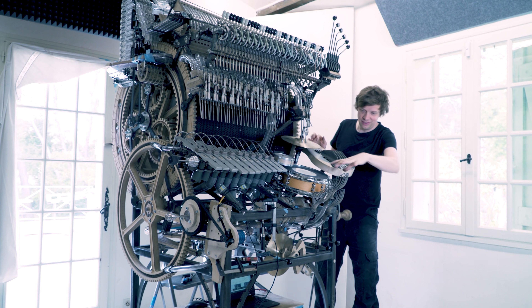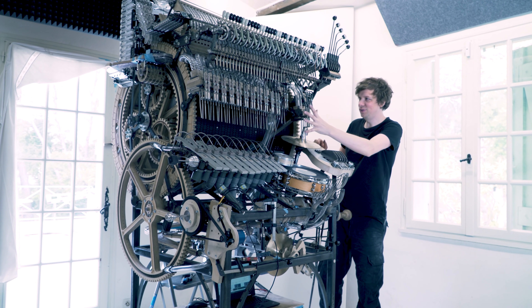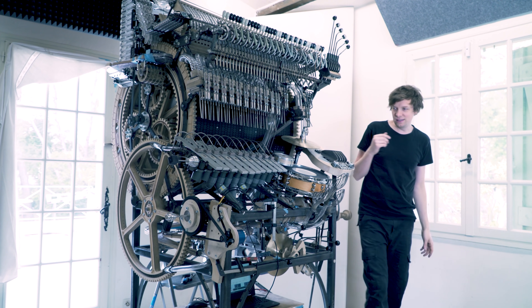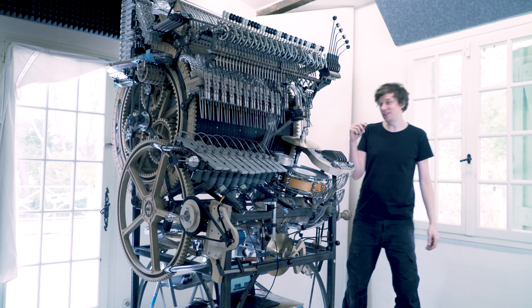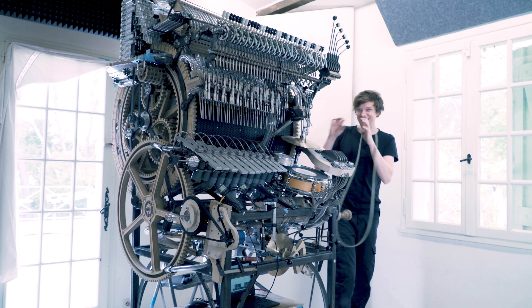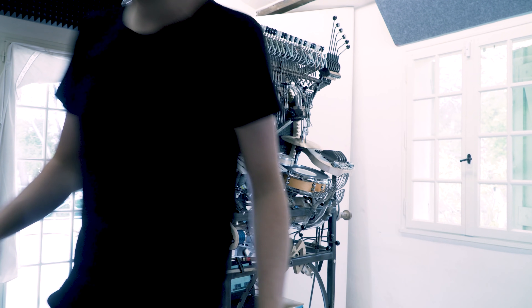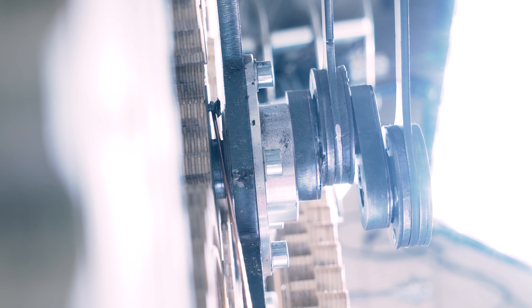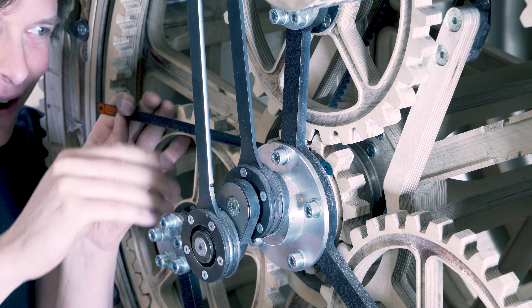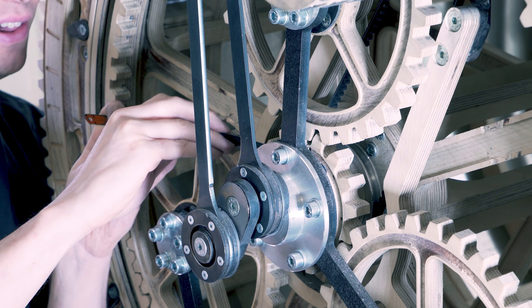I have been going a little bit crazy today because while the funnels are there and I made the drops work, all of a sudden the motor stopped working. It couldn't turn the machine — the tempo went down and down. I texted Alex and he was like, 'It's probably resistance in the machine somewhere.' So I disconnected the conveyor belt and the fish there, and then I felt the wheel on this side — I couldn't turn it by hand. I found some resistance — this little screw had unscrewed itself and it stops the whole machine. The only thing I can do is cut it off. This makes me a little bit worried about the machine on tour — it's so vulnerable. We have to secure all things like this.